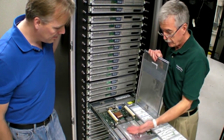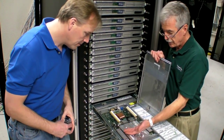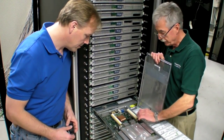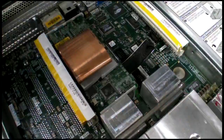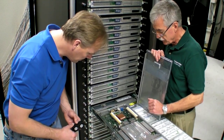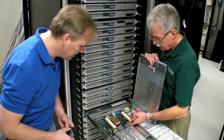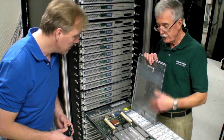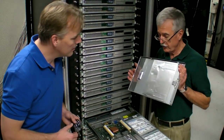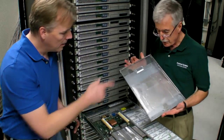We've got the CPUs and VRMs here — bringing the heat up to the surface. We've got the DIMMs and DRAMs again with a little aluminum shell bringing the heat up north. North bridges are also bringing the heat up. Then we've got some low-dissipation devices. The management card provides a little bit of heat, so we've just put a small radiator on top — that's the LOM — and we're getting enough radiation and convection within the cabinet that just the lid cools it sufficiently.